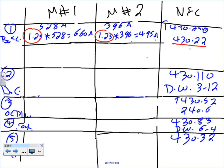Okay, so that's the full load current that I need to size based on. Now I need to take these amps and size the branch circuit based on these two amps. Then you're going to go to Table 310.15(B)(16). Do you guys remember that? And under which column? Anybody can tell me, if it's motors, where is it going to go? Always default to 75 regardless. If it's a motor, you're going to default to 75 degrees Celsius.